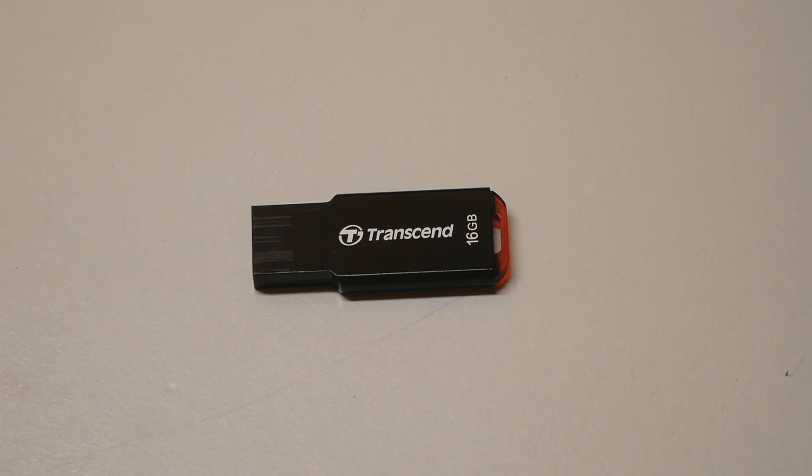The actual process is very simple. You have to format the USB stick to FAT32 format, then place the BIOS file at the root of the USB stick. The BIOS file also has to be named correctly according to the actual model number of your motherboard.